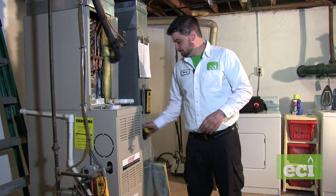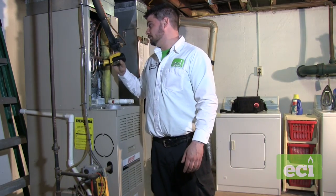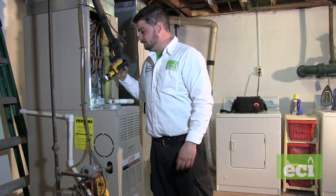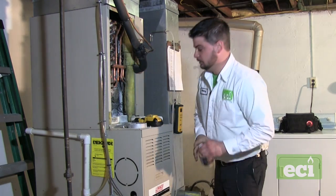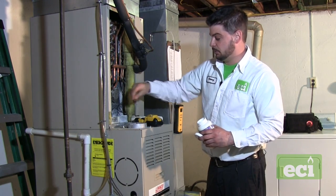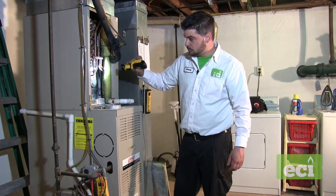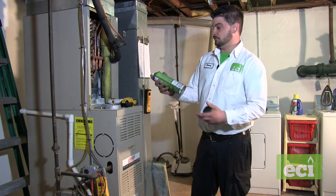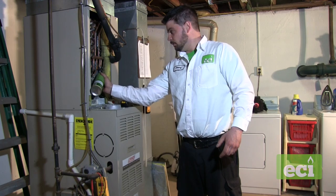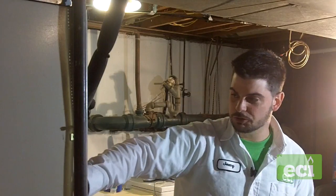Using a flashlight, visually inspect the outside of the coil and look at the walls. There are some concerning spots and mold visible in the pan. We add pan pills to the condensate pan — this is a two-ton unit, so I'm adding two pan pills spread out to kill any bacteria growing inside. We look inside the coil to make sure there's no hair, mold, or anything obstructing airflow. We spray a disinfectant, which automatically rinses the coil and lifts any dirt. With yearly maintenance, this is all you need to do.